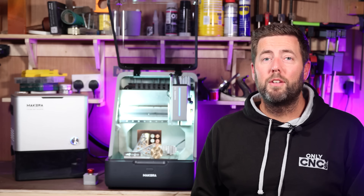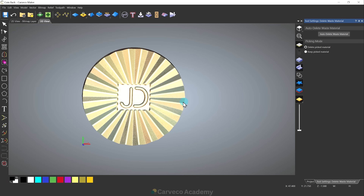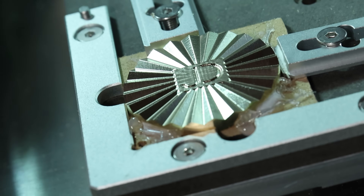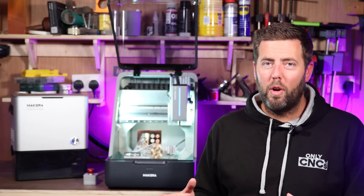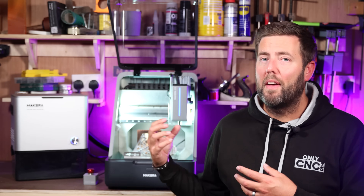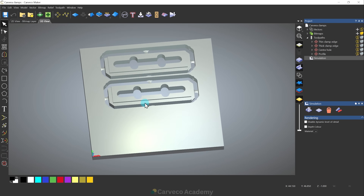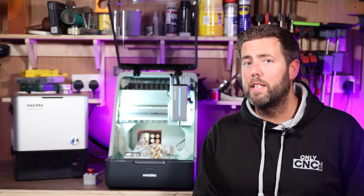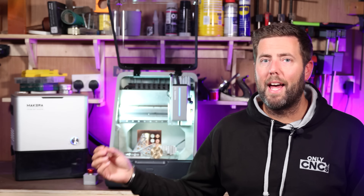Will it handle 3D models? At the end of the day, the machine just runs off G-code and will do whatever you tell it to do. So as long as you can produce that in your CAD/CAM software — whether that's something like Carveco Maker, Fusion 360, or even their own CAM software — then yes, the machine will handle it. In terms of what software can actually be used with this machine, pretty much all the most popular softwares can generate files it can operate from: Carveco Maker, Fusion 360, Vectric software — they're all going to be able to output files that can run on this, including obviously its own Makera software.